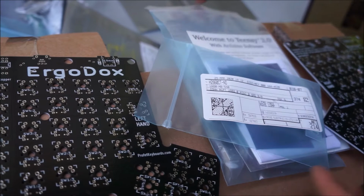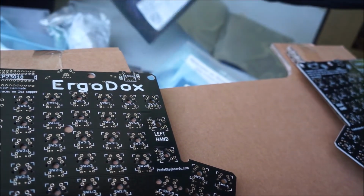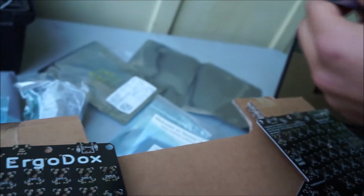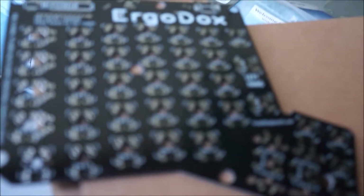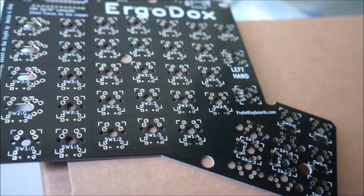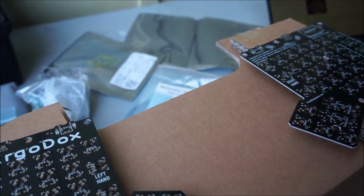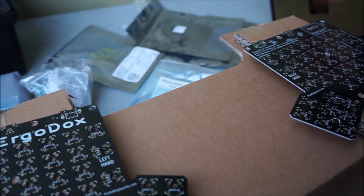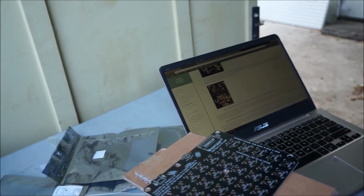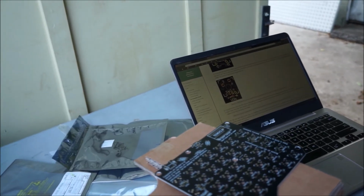So okay. Right now we're starting off with the diodes. So what we do, where'd those go? Is we feed them through, solder and clip. So we're working on the diodes now. Okay. Let's see. So through-hole diodes, place them through the two holes immediately left and right of the copper pads under the square the switch will take up.